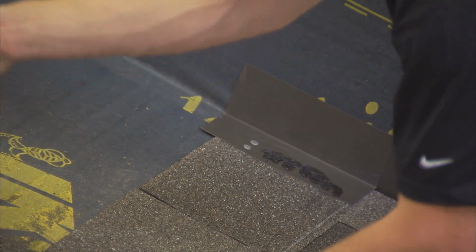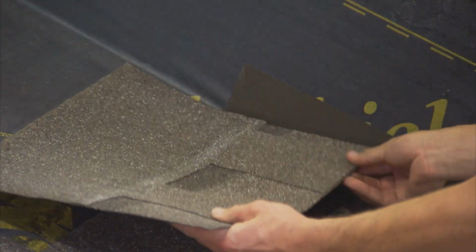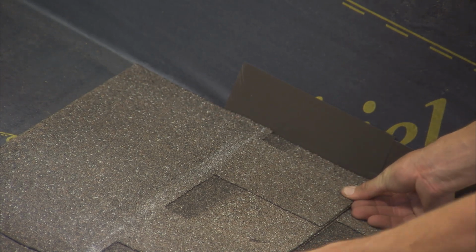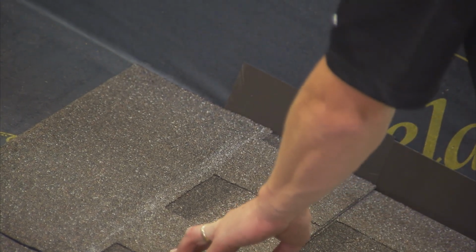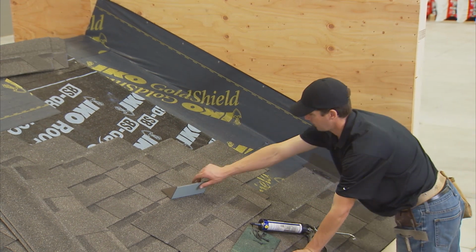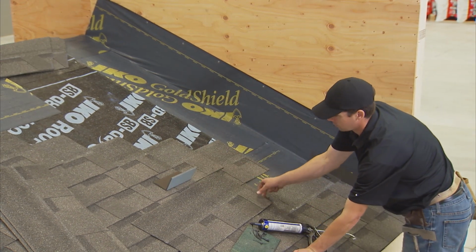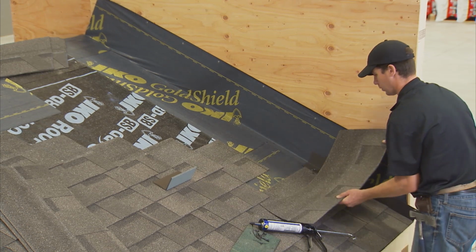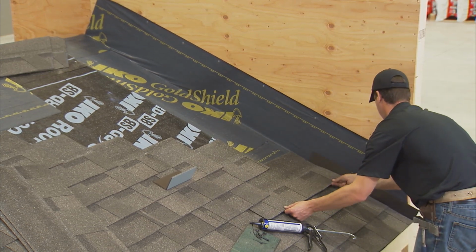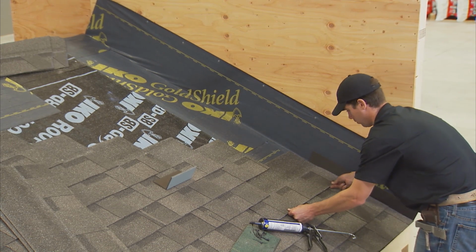Place the second step flashing shingle over the end shingle in the first course by positioning it 5 5/8 inches above the bottom edge of the exposed asphalt shingle. Make sure that the tab of the shingle in the second course will cover it completely. Secure the horizontal flange to the roof. The second and succeeding courses will follow, with the end shingles flashed as in preceding courses.